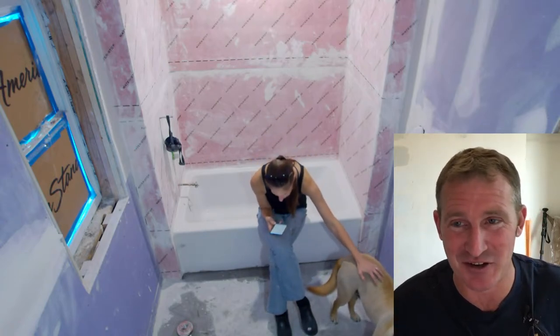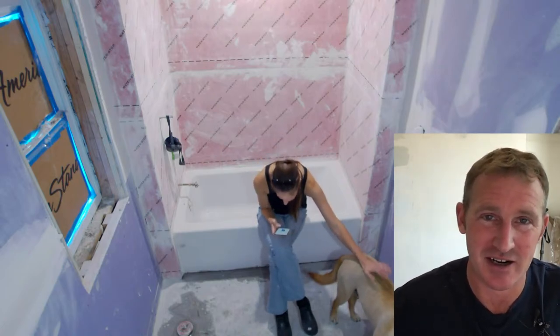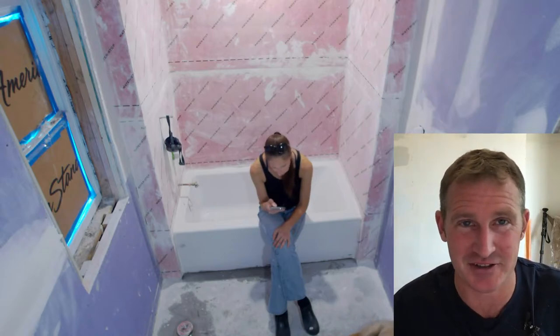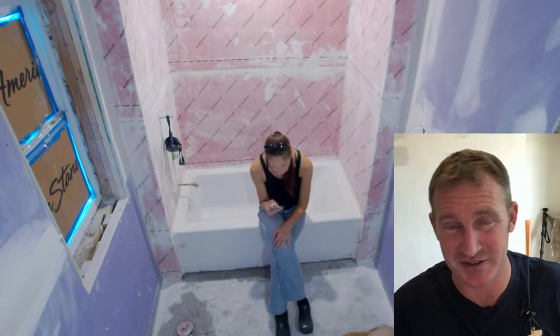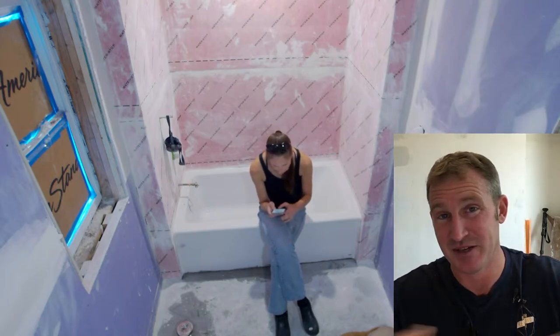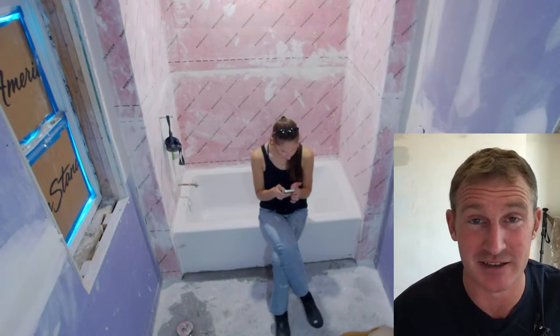So I think if you're going to spend all this money to renovate a bathroom, you really should waterproof the flooring before you get into the tiling process, or even if you're going to be using vinyl plank. If you're going with vinyl, I also think it's a great idea to waterproof underneath. Most of this vinyl plank now is basically clicked together. It's a floating floor system, and if you want to go to tile later on, you can just tear it up and then start tiling over that new waterproofed system you have underneath there.